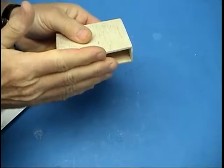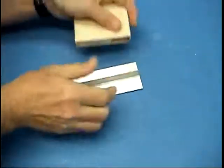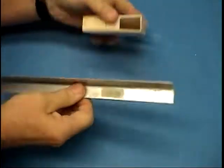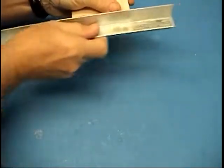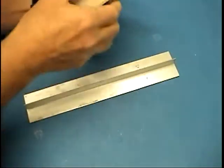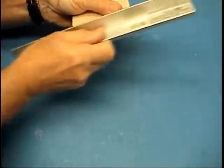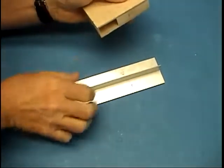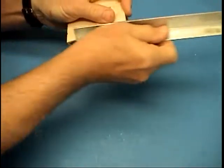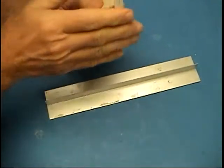Now before I can actually fit this up really accurately, I have to establish a flat surface on both sides so that these two parts come together, because once I resand that, these parts are going to move. So anytime I'm working on a flat surface, I want to have both parts, when I tighten this bolt, tighten up reasonably well. I don't want to have to shim them or add material if possible, but of course if I have to, I have to. But it's easier to work on this early on. The earlier on you can get these surfaces to mate, even if you're just building a ship that just has a cowl, the surface mating part of it, the sooner it can happen, the better.